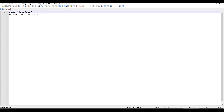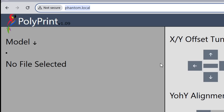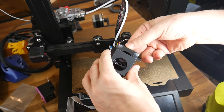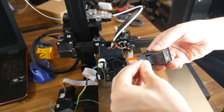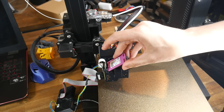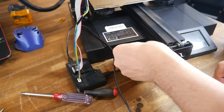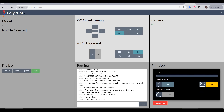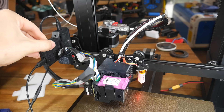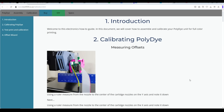Like a 32-bit 3D printer, when we power it on, the firmware will flash and update. This can be verified by the firmware file changing from .bin to .cur. We can now add a file called Wi-Fi.txt and add in our SSID and password for our network. When we boot up the Polydye main board, we should be able to connect to it using the phantom.local URL — and it is important to use this rather than the local IP address. With the firmware working, I finished off my install by sliding in the part cooling and heatsink fans into my printed shroud, bolting the shroud back onto the printer, removing the protective strip from the ink cartridge, and inserting it with the pins facing the interface board. We can also plug in the USB cable between the 3D printer's main board and the Polydye main board. Polydye should connect automatically and you can send something like M503 to confirm serial communication.